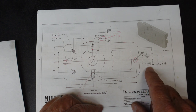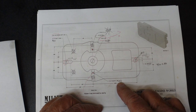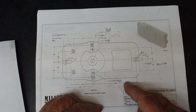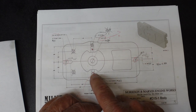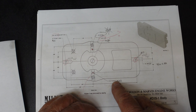One of the things here is a tap a hole — it's a 1-72 UNF, which takes a number 52 or 53 drill; should have been a 52. This is a 4140 steel casting and some of this stuff when I was drilling holes was just hard spots in it. I've drilled it and I started playing with the tap, but I don't think I'm going to tap them — I don't think I'll ever need that. Don't tell anybody I didn't do it though. I'm not going to snap a tap off in it; the thing is minuscule.